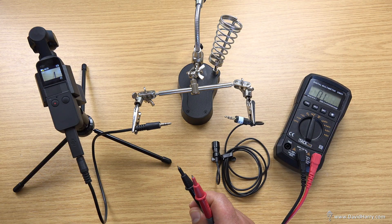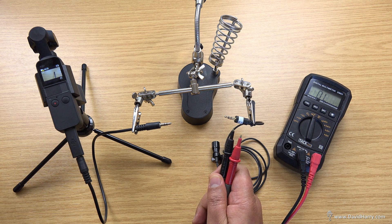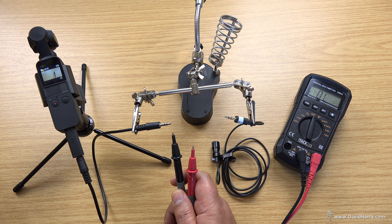So just quickly, let me sum up what this means. This lavalier is designed to work across left and right — tip and ring — by normalizing poles one and poles two. Whereas the pocket adapter is definitely two discrete independent inputs, both of which are supplying a positive voltage of thereabouts 2.6 volts.